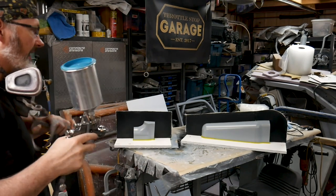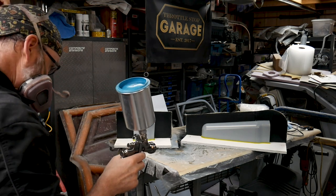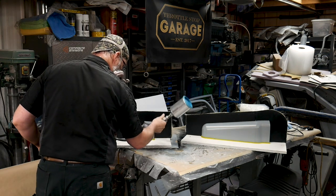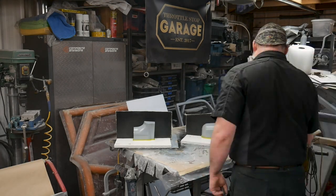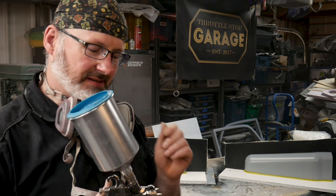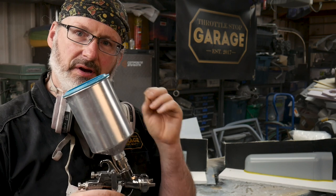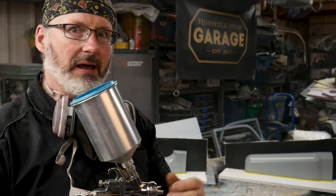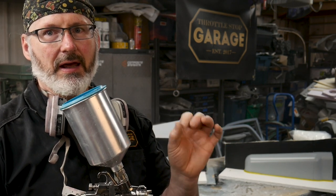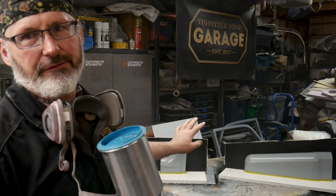The molds have been waxed and everything's ready to go. The droplets are so very fine — that's what you want. You want them to be extremely fine so when they atomize and get blasted by the air, they spread out properly. If you have too much fluid flow, the droplets will be quite large and they'll try to coalesce, which is going to create all kinds of problems — runs and other things with PVA.